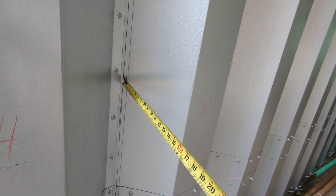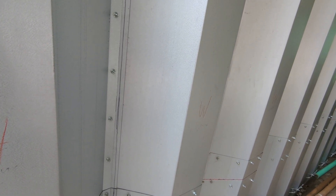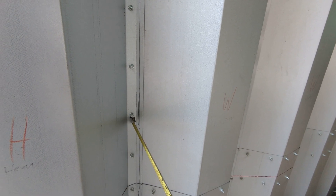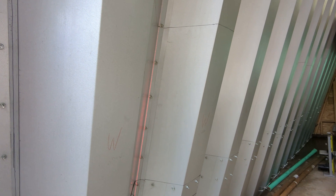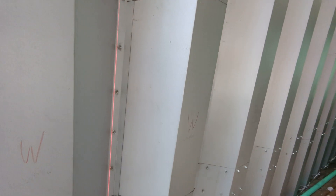On our first cut we stayed right on the inside of the ridge, which was not the right answer. You actually need to overlap by about a half inch or a little bit more. Steelmaster's text says do not cut out the bolt ridge at all or it will install incorrectly — you need that to field-drill your window box when you get it in there.